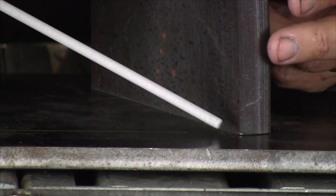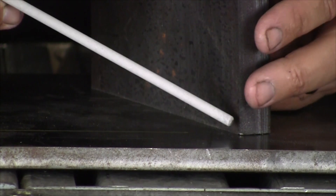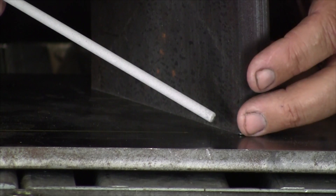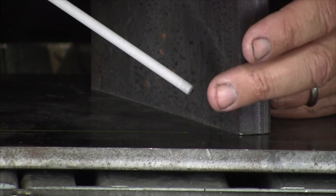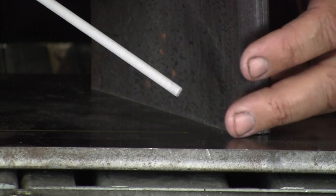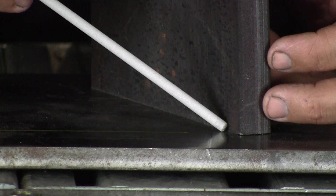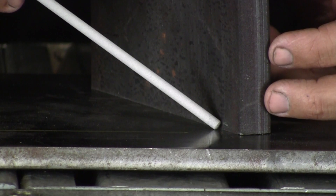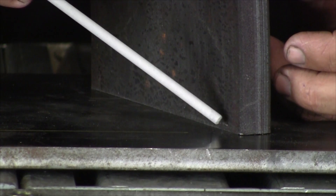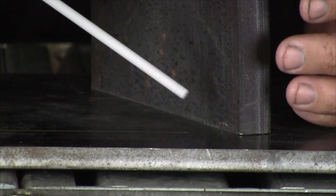You control the amperage and set it to what you want. The problems you run into involve the arc you've created. This is called long arcing — you've created too great a distance between the negative and positive electrode, and the arc goes out or the weld dies because you've drawn too far away and it can't connect the current anymore. Short arcing is when you're too close and you freeze the rod in the molten state, sticking the rod and the weld freezes. So there's short arcing and long arcing — what we want is to float the electrode at a constant distance as it's consumed and drawn into the weld.